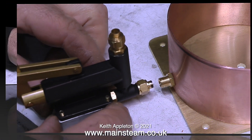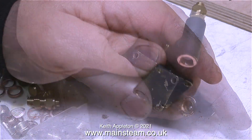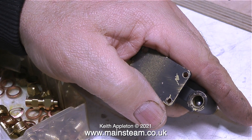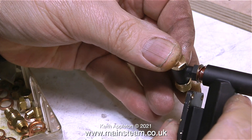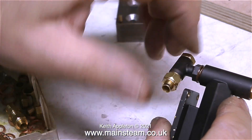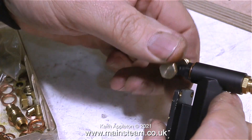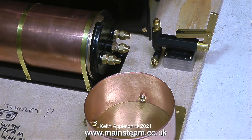This bottom water tank outlet is going to be connected to the water pump's inlet using a short piece of pipe, but unfortunately the right angle fitting is in the wrong position. This was an easy fix — I just used a couple of shim washers of the correct thickness and re-tightened the fitting, and now it's where I want it to be. Not only is it at 90 degrees to the vertical part of the pump body, it's also at 90 degrees to the horizontal part, which allows me to mount the water pump on the baseboard in a sensible place where I won't burn my hand when pumping water into the boiler.